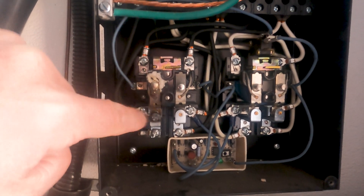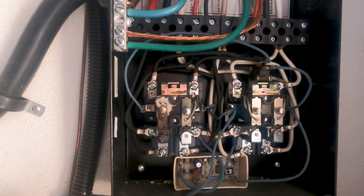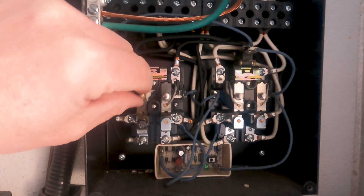When I came out here, this was all loose, and this is why it wouldn't kick over. So as an interim fix until I got a new switch, I was able to use five-minute epoxy on this, and now it kicks over and it works just fine. What I'm going to do is set up the camera and fire up the generator so you can watch this kick over.